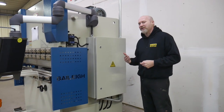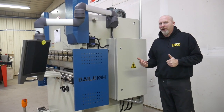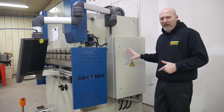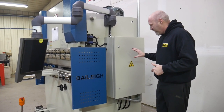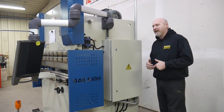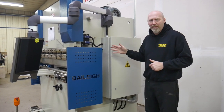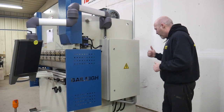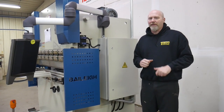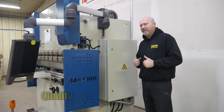When we received the press there were a couple of additional things we had to handle. Our existing forklift wouldn't be able to handle it, so we had to get a larger forklift because the press is about 5,100 pounds when delivered. We also had to wire it — it takes three-phase power; I believe it's a 30-amp three-phase breaker. So make sure if you're purchasing one of these presses that you have that capability, or you could run a phase converter.